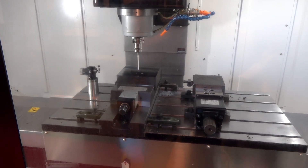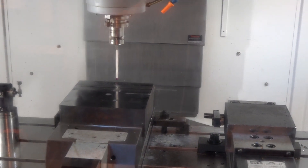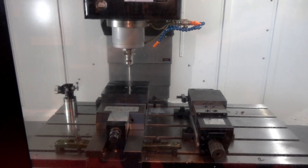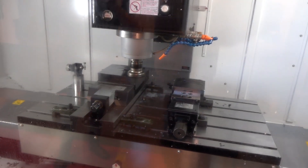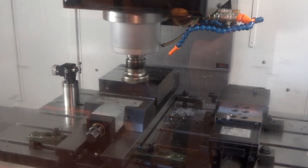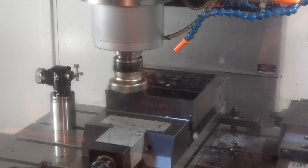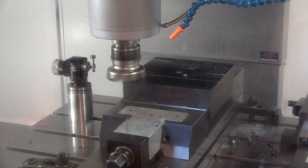When you're going into the field and challenging competitors with VMCs, what's the biggest point you press about these? Because of the geared spindle motor, it really allows you to just hit it as hard as possible with no detriment to the actual finish. The metal removal rate on this is the biggest selling feature. It's BT40 this one, but they do come with BT50 spindles as well — just to make sure the metal removal rate is at the absolute maximum.